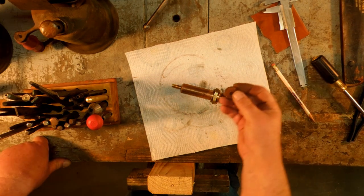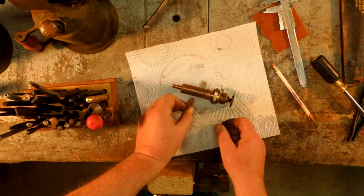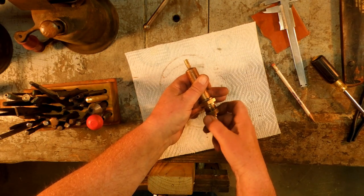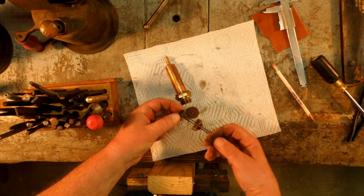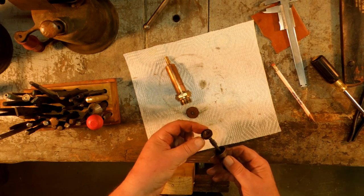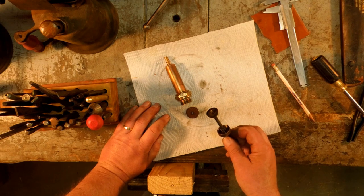So Steve, that's how you make a piston for your pump. When you have your leather all oiled up and formed to make the piston, when you pull the piston up, the air just goes past the piston. There isn't any air pressure on the back side of this as you're pulling up. It actually creates a vacuum, so it just draws air past that leather seal. So there's no check valve in this part. It's just the leather presses out when you're compressing it, and then it folds up when you're pulling it out. It acts as its own check valve.